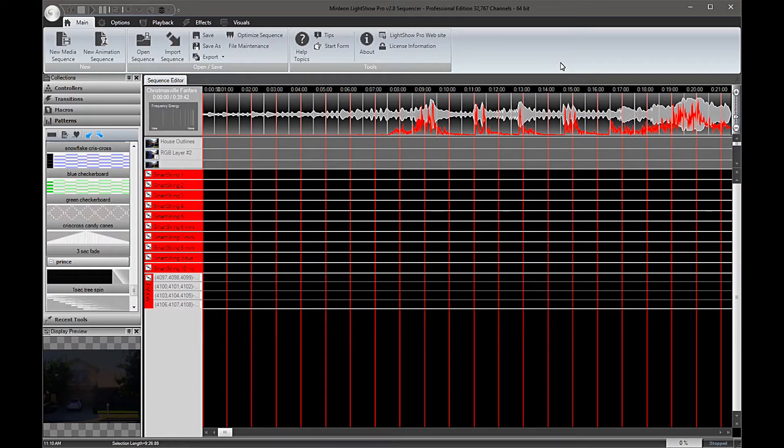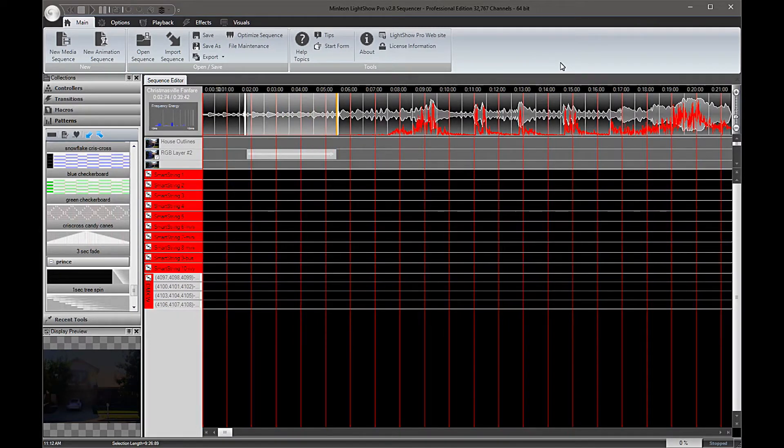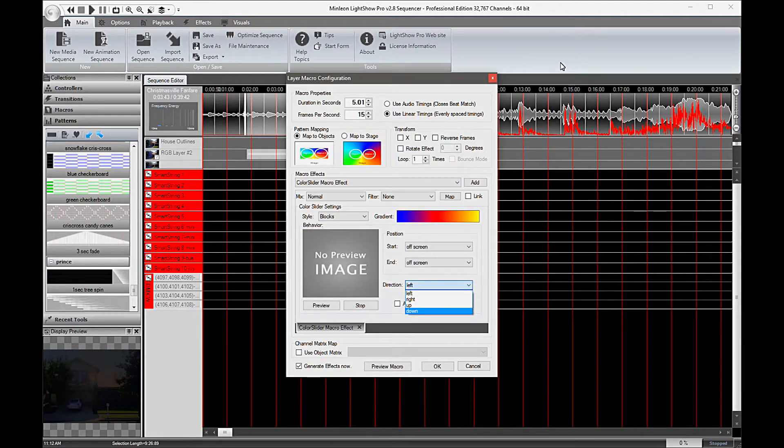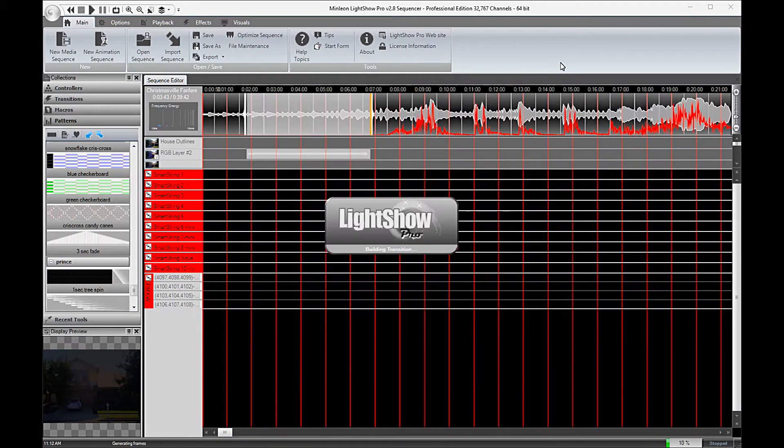I've already drawn the images for the remaining controllers. We've got 5 strings outlining the house, 3 strings for mini trees in the yard, one for the bush on the side of the garage, and one for the ivy — a total of 10 128-pixel strings, each with 3 channels each, making a grand total of 3,840 channels across all those smart strings. In addition, I've set aside 12 discrete DMX channels for DMX floodlights to complement the RGB pixels on the house. Once all channels are virtually represented, it's easy to generate effects by dragging across a section. We'll demonstrate the slider effect: select a color pattern, tell it to move upward, apply it to all RGB channels, click OK, and it'll generate those animations — mapping to where each RGB pixel is on the display and generating a broad color rainbow movement effect.